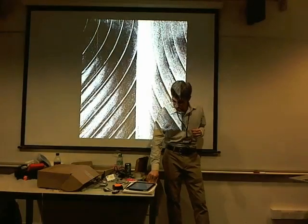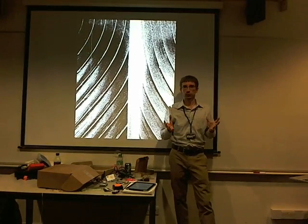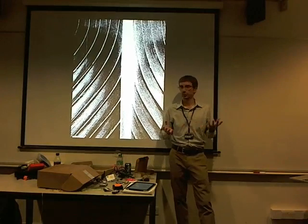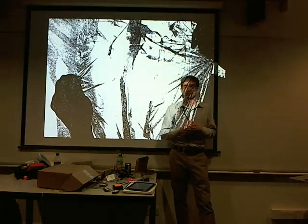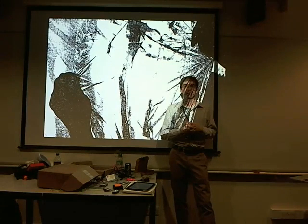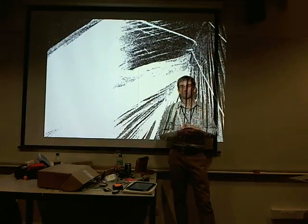One of the basic problems is creep — where your plastic stretches irreversibly when pulled higher than a certain tensile force. The solution is simply don't pull it that way. Before the advent of strain gauges you could put on balloons, it was very difficult to even tell how much pressure was inside these balloons for a long time. Very few flights had pressure sensors. Today we have electronics that can give us a lot more diagnostic information and enable faster innovation for anyone attempting superpressure balloons.